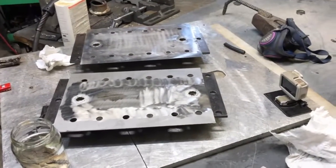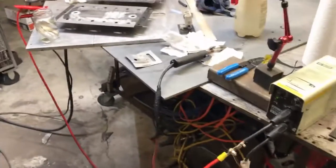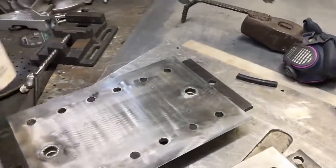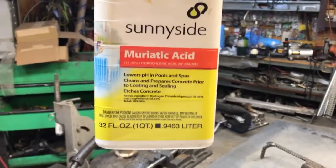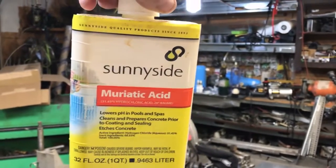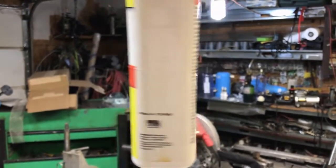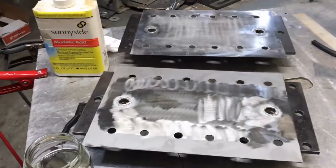That's my take, and this has been stainless steel passivation using electrolysis with regular muriatic acid — this is hydrochloric acid. Do not leave containers of hydrochloric acid open in your shop; they will rust every piece of steel and every electrical contact available, including micro switches, stereos, CD drives in your computer, and things like that. Heads up on that, fellas.